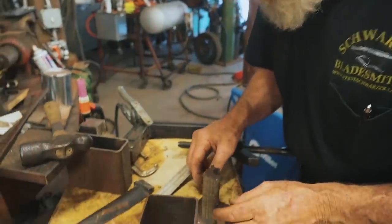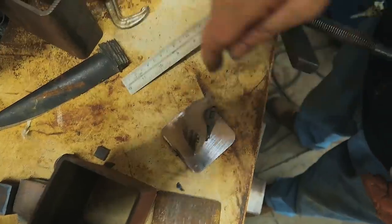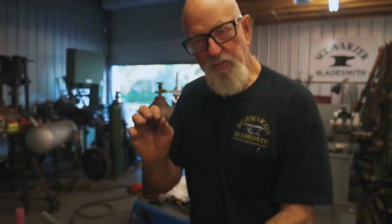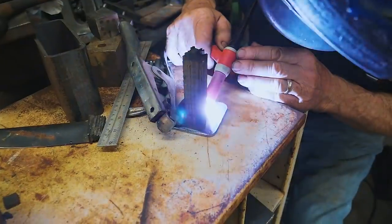All right, one of the reasons why this thing is set in here on a bias is it leaves me with the same amount of powder around the outside. And any powder canister, you gotta have about a 30% reduction in order to get the interstice out of it. Those little tiny spaces between the powder before it solidifies. More even that space, the more pristine your image is. And that's why we set this like this, to get an even spacing. And we can tack that bad boy.